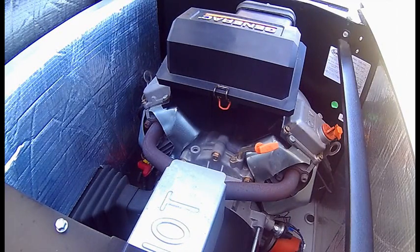It's an extra wiring from the transfer switch, but it may be required if you've got a smaller generator or just have too much of a load on the big ones. It prevents you from buying a big one. You buy a 24 kilowatt, 100 amp, and you still need more. You need 200 amps in your service. You can go through the load shedding option and do it that way. So, shed loads.